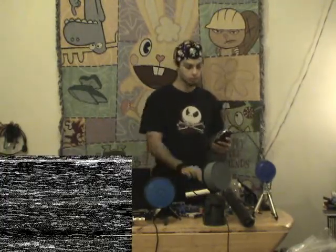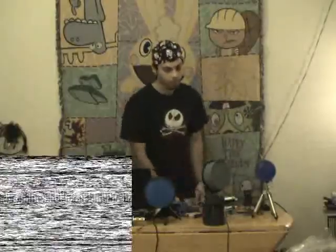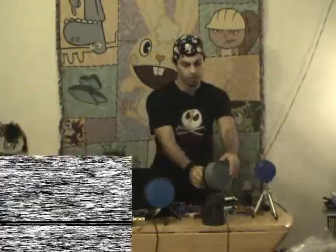So if we actually go off center axis, you'll notice that it'll start to fade away. And then if we go back, it'll fade in. And this is one of the tips that you really should try to use with wireless video scanning. Every time a signal reflects off of a metal surface, its phase will actually rotate 90 degrees. So usually that's why I take a helical antenna when video scanning. In fact, let's hook up the helical and see what kind of signal we get from the helical indoors.